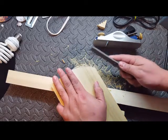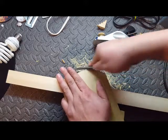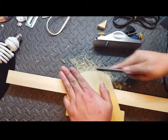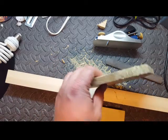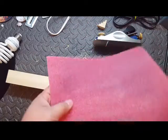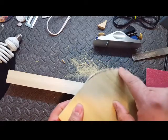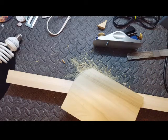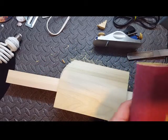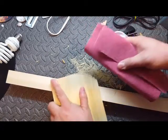So you get your file, or your plane, or your rasp, or whatever you want to smooth out the edges. Imagine if this is perfectly done — then take some sandpaper. Since this is such a rough grit file, I only get as close as possible to the line, leaving some meat in there for sandpaper, because these will leave deep gouges. So get some sandpaper and a block, and flatten it out on that block.